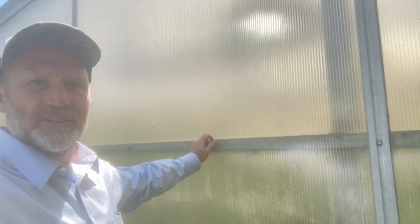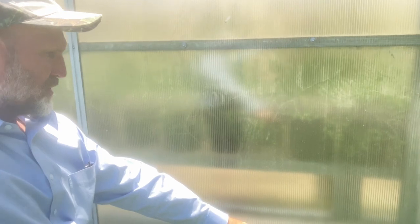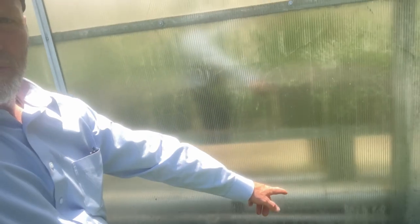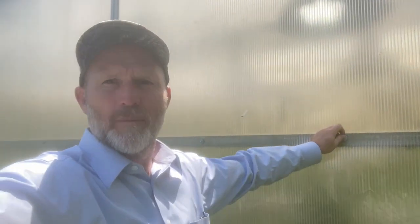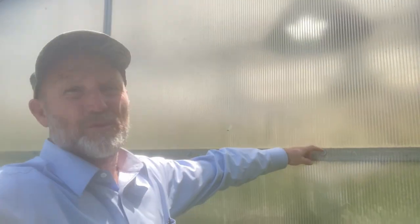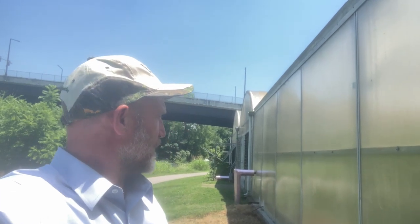One thing that's worth pointing out is the small number of screws that are used to fasten the polycarbonate. As you count this, if you look at the bottom, there's a J channel trim on the bottom, so you're going to have screws going through that. They didn't use an oversized washer on the bottom, which I think is interesting. They did here, but it's a very small washer, probably on the order of maybe 7/8 of an inch. We use 1.2 inch or 1.5 inch. We wouldn't go that small with our wind load. Similarly, you have the trim up on top, but overall there's just a handful of screws. I think if you counted it up, you'd be on the order of about 15 screws for an entire panel. So it seems a little light, but that's how they're doing it here.